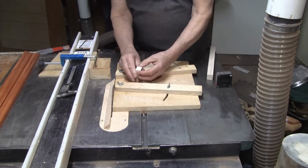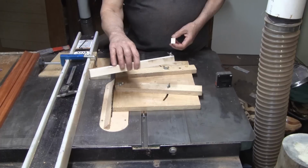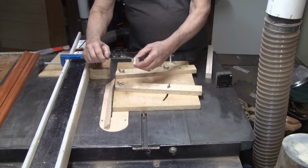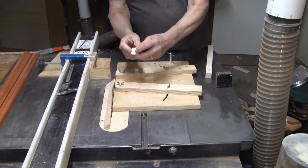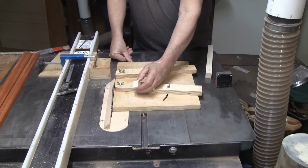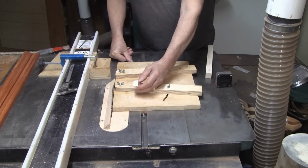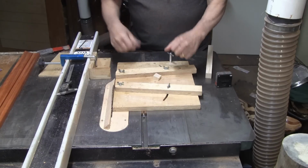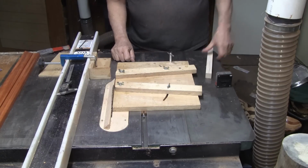After making my first cut, and I always like to take a little scrap to set the thing up, I'll measure it with digital calipers, make sure it's exactly right. This is 3/4. If I allowed it to be a 32nd big, 25 of those would be slightly bigger than 3/4 of an inch. Your ring's going to grow, it's not going to be what you designed.